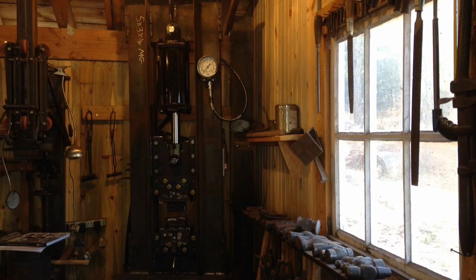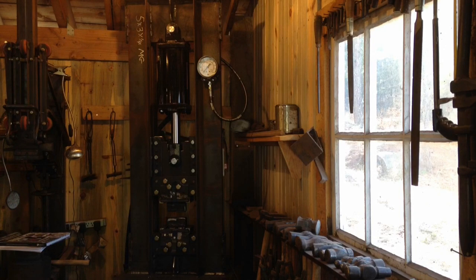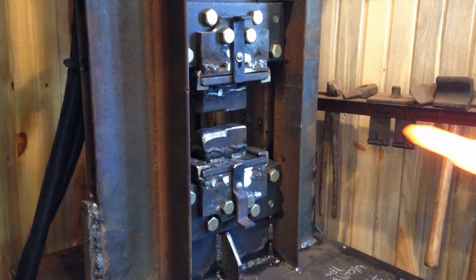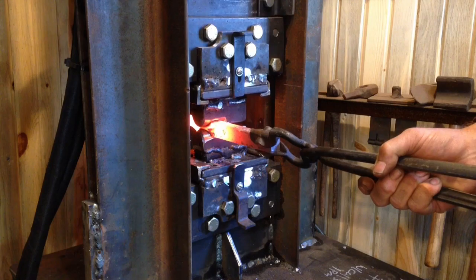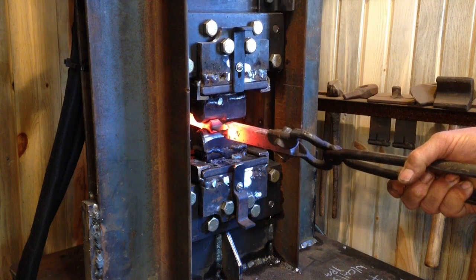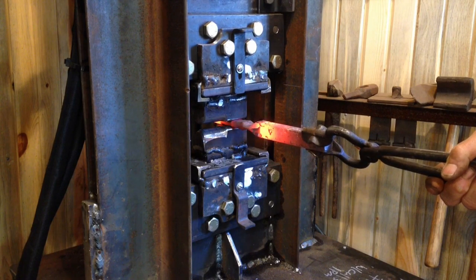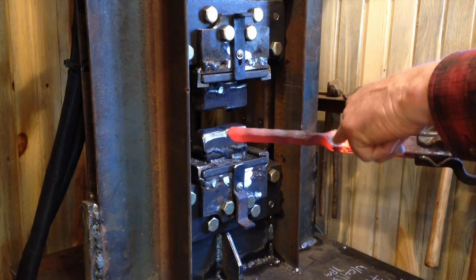Different dies will have different effects. I'm going to move the camera and we'll see if we can get that to forge at a higher heat. We got that bar hot again — this is a much better heat this time. You can just see how much force that takes. Now that's full force of the press right there, and you can see how far that took that down. One problem is it does cool things off, so you've got to take that into account when you're working with the press.